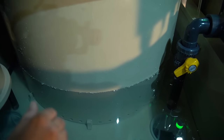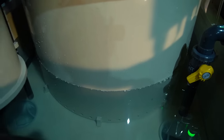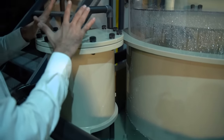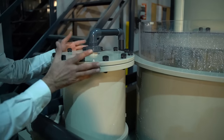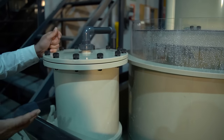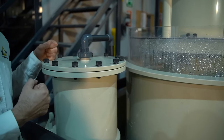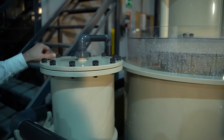The clean water passes through these bag filters, which are capable of filtering from 1 micron to 100 micron. We also have this bypass line going into this chamber where we can fill activated carbon, calcium beads, or similar media, depending on what we want to remove from or enrich in the water.